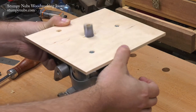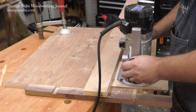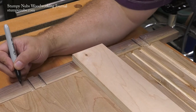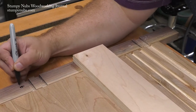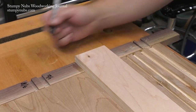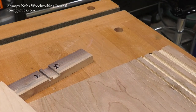Once the plate is attached to your router base and labeled, it's time to use it. Choose one of the four bit sizes, chuck it into the router, clamp your T-square guide to a panel, and make your cut with the side of the plate that matches your bit against the fence. The first time you do this, the bit will cut a groove in the cross-piece of the guide. I went through all four bit sizes right away, placing the corresponding edge of the base plate against the guide and making a cut. I ended up with two grooves on one side of the cross-piece and two on the other. I labeled them with a Sharpie so I could keep track for future reference.